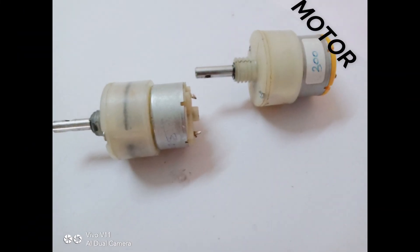The 4 DC motors, each of 300 RPM. Motors of higher RPM can also be used, but then the torque decreases. A solution to that is using Johnson motors, where on increasing RPM torque does not decrease, but then it costs you a lot — so choose wisely.